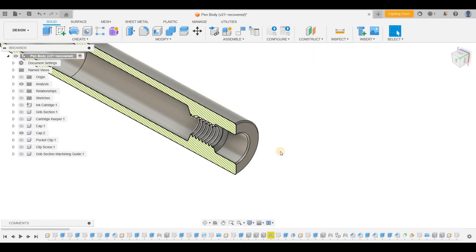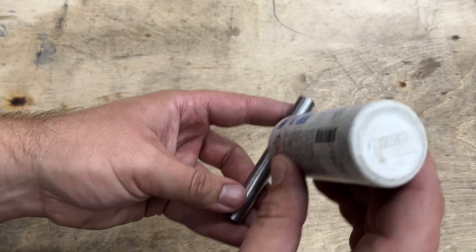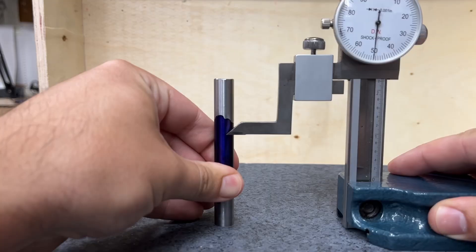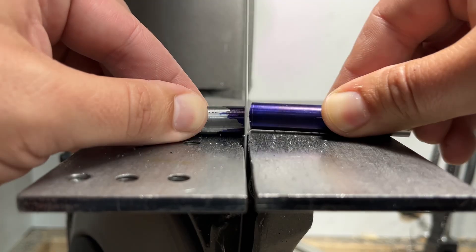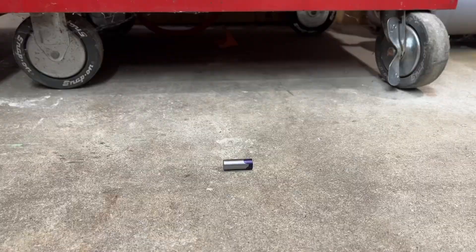I have finished all the machining in this setup, but before I can start working on the other end of the cap I need to cut off the excess material. I take the bar out of the lathe and apply some layout fluid to mark where to cut. I set my height gauge to 2.25 inches and scribe a line all the way around the iron before cutting off the excess material on the bandsaw. This little section I will need later on, so I'm going to put it in a safe place.